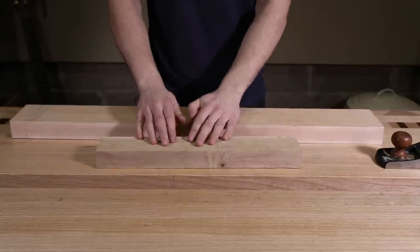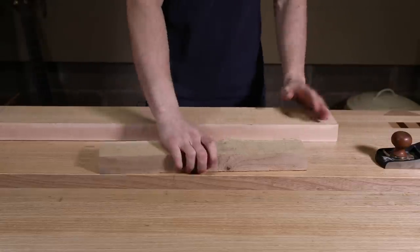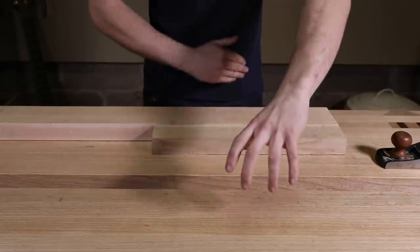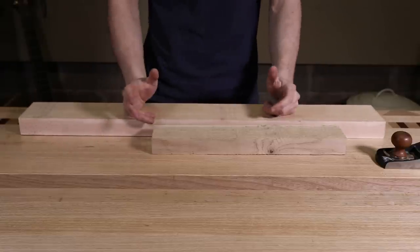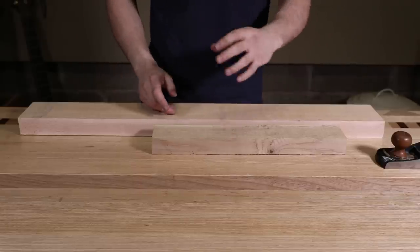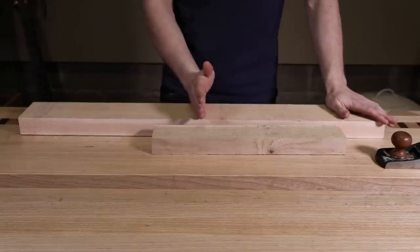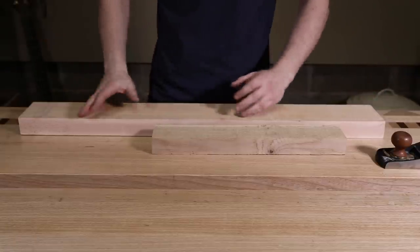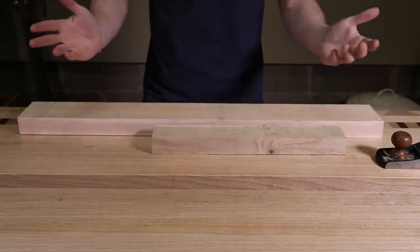It'll be a lot more apparent once we plane it and put a finish on it. So the way this chopping board is going together: we're going to sandwich this oak between two halves of this beech — we're going to cut this in half, spin it around, and put it on this side. The reason for this is because beech varies in colour quite a lot: sometimes it's quite pink, sometimes it's quite yellow, and sometimes it's a browny hearing-aid colour. So cutting it in half like that means the two halves will look nice and pretty at the end.